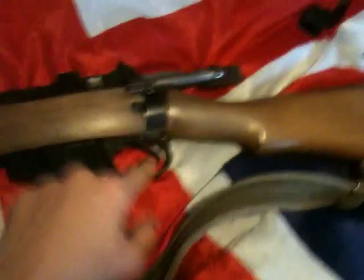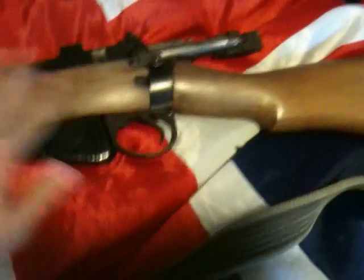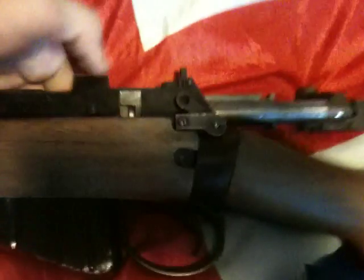On the Mark 2, the trigger is on a little block inside, which is why I had to cut out all the wood between each side to make room for it. Half of the metal backing plate is also missing as it's an L59A1. Another main difference is the bolt — it has a little button catch. You've got to push that down and push it through; it will never come up on its own. Even if you pull it back you can't lift it — you have to push it down, pull the bolt back, and then it lifts.